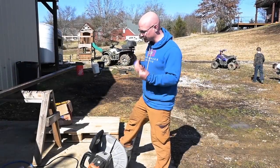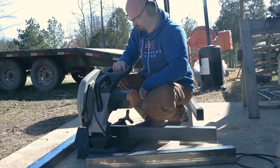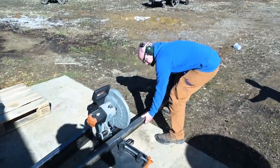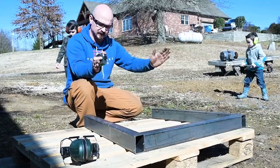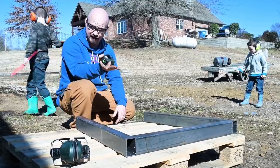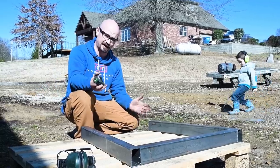Time to work on the base, which is all steel. Coming outside because I'm going to weld out here anyway, so may as well cut it all out here. The base is going to be a trapezoid, as you probably saw on the thumbnail. I cut the tops and all four sides since they're going to be the same. I have a model, but because I'm working with angles and probably didn't exactly match my draft angle, I like to set it up and measure for my last piece to make sure it actually fits — that's just going to make everything come together better.